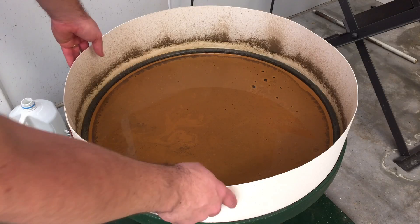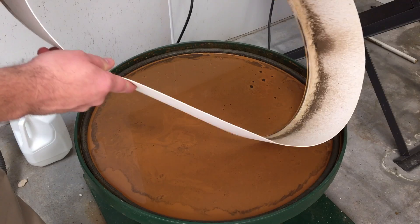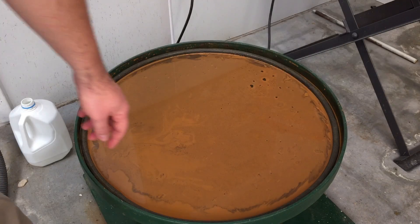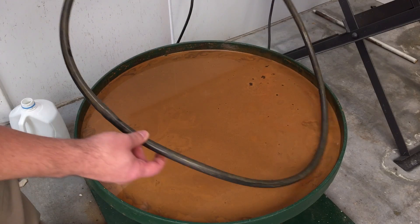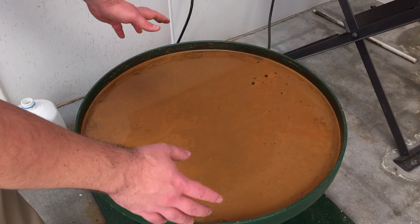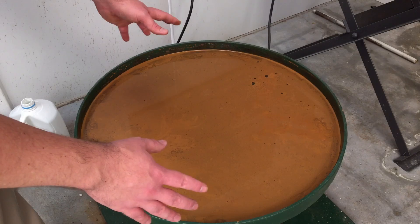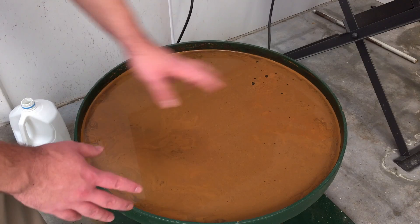The first thing you want to do after your glass is gone is to take out your splash guard. This is easiest to take outside and hose off — it's pretty nasty in there with a lot of grit. You want to get this cleaned out before you put your next stage in. The same thing applies to your bumper ring — it's also going to have a lot of your rougher grit on there, so take it out, take it apart, and wash it off really well. At this point you can take your pan off your Reciprolap and hose it off outside, or you can leave your pan on the base and just use a shop vac to clean it out — flushing with new water and suctioning that out until you've got it nice and clean.